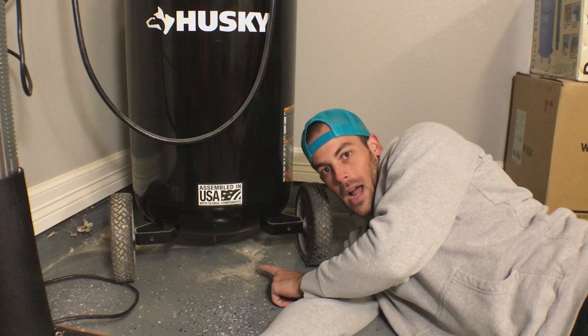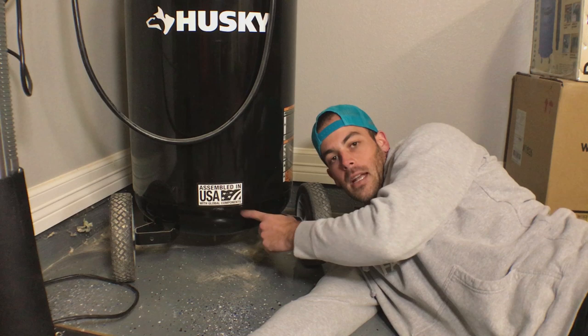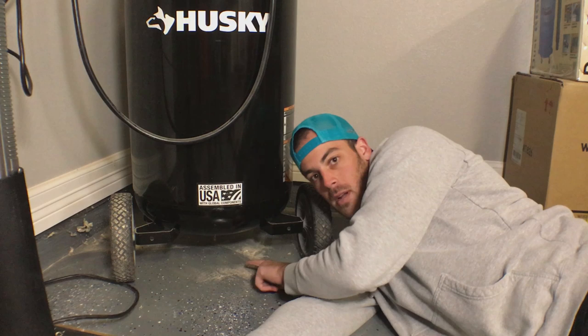The second way is a better way to drain water out of your air compressor. If you've never drained water out of your air compressor, you should. As air is compressed, water condenses. Over time it lets water build up in your tank. Why is this bad? Your tanks are carbon steel. Carbon steel rusts, and a lot of rust is bad because it will eventually compromise your tank and could potentially kill you. This is one of those overlooked and potentially dangerous details in your shop.